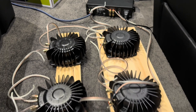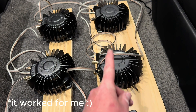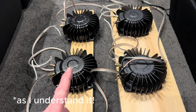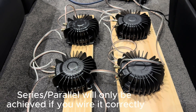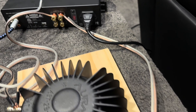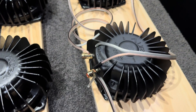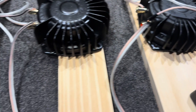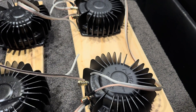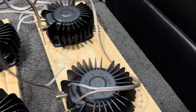This is my understanding of the unit — I'm not anywhere near an expert on this. These two bass shakers here are essentially running in series. These two over here are what makes it a series-parallel configuration based on how we wire it. The connection coming through on the right-hand side goes from the positive connection, running to the positive connection here, and from that same positive the wire runs to the positive on the bottom-left shaker. We then connect between the positive and negative of this bass shaker to join those.